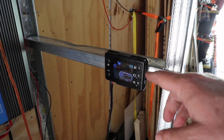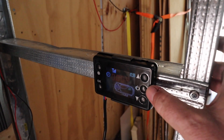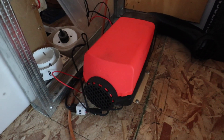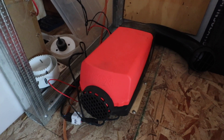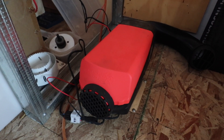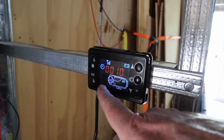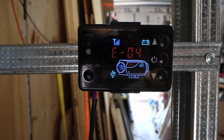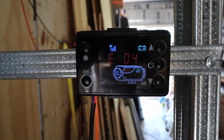I went ahead and turned that off. It was blowing for two or three minutes. I think it's primed, so I'm going to try a normal startup now. I just pressed the power button — doing my first test burn. Let's see if it starts. Normally it's about 30 seconds before you start hearing the click click click of the pump. I don't see the pump icon, which is normally what you see at this point, so it's like the pump is not working for some reason. I have an error zero four here and the pump icon is flashing. Maybe it just doesn't have enough fuel yet — maybe the pump is not quite primed.